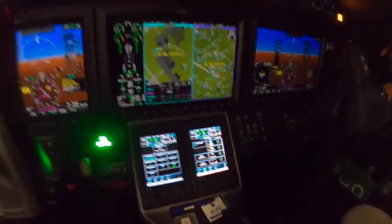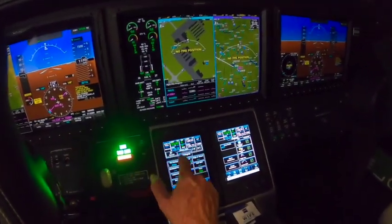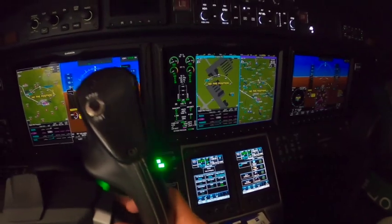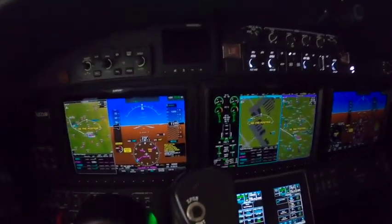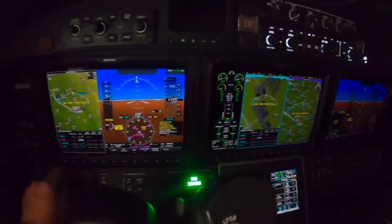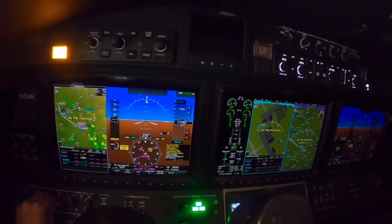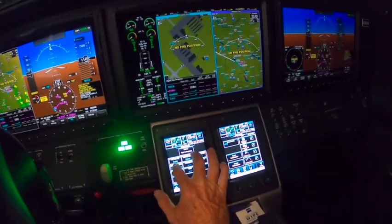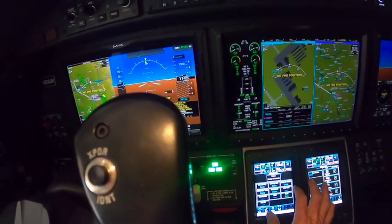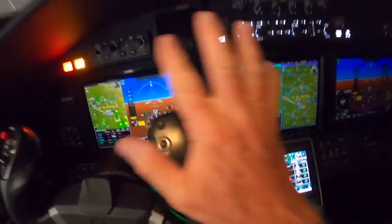Next we would do our fire warning test — it lights up. We can get rid of that. Fire warning done. Landing gear — it's going to chime, and this is only if I had the speaker on. Turn the speaker back on so you can hear it. Landing gear, we hit the button. Angle of attack indicator — the stick shaker's going. Windshield over-temp: we open the bleed air valves, go to low, and look for the light. There it is — windshield over-temp. Turn it off, close the valve. Overspeed — it's going to chime. There's our overspeed. Anti-skid fail — all right, that test is good.